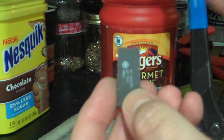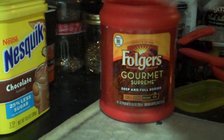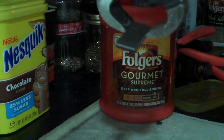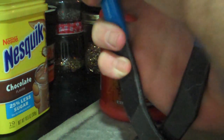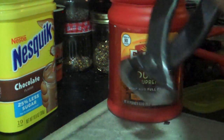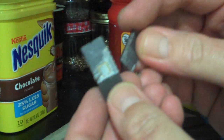If you want to get into a ceramic chip, get the nippers. Open it wide enough, put it into the cement line — like I saw — give it a bit of a squeeze and a tap. Ta-da.